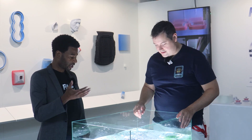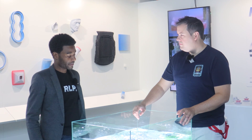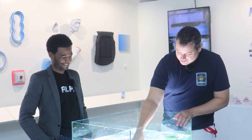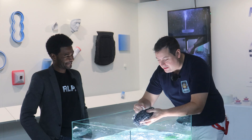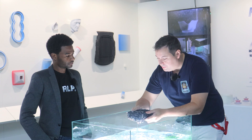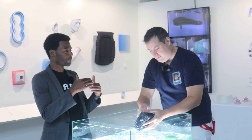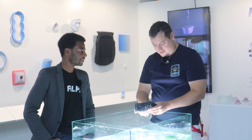And the parts, once they're done and rinsed, are industry-standard and performance-ready. They resist heat, cold temperatures, and don't break down with UV like other systems on the market — because you have all the benefits of silicone: incredibly flexible, incredibly durable, incredibly reusable. And you can produce really complicated geometries like this — almost unthinkable lattice designs that you can't achieve with most FDM machines, and even in SLS it would be difficult because of how fine the lattice is. And taking it a step further, within these lattices we can actually embed bladders, which pushes forward what foam or cushioning systems can become — creating bladders embedded inside lattices for the future of comfort and seating.